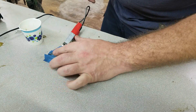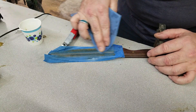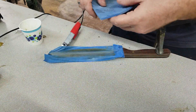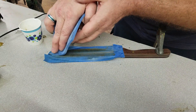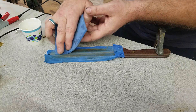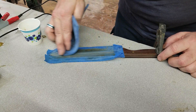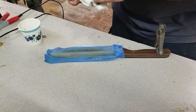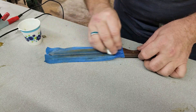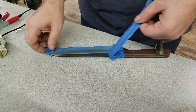If you want to clean the etch up a little bit, just take a real fine sandpaper — like 1000 grit or 2000 grit, doesn't have to be anything crazy — and just go in and lightly sand over the spot that you just etched. It's not going to make it shine like brand new; it is still going to have that etched look and be a little darker overall. But this will clean it up and smooth things out some. Then take a wet paper towel to get down into the etch a little better and clean everything up. Then you can peel the tape off.